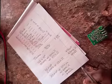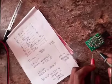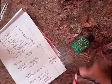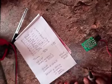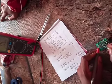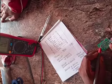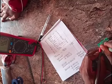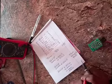All right. Now, we are going to use our meter to try to confirm if it is correct. But one thing we should take note of is this: because it's inside a circuit, the value might not be exactly what we have there, but just know that it's a 47 kilo ohm resistor if you take it out of the circuit. All right, but let's just see what value the meter would read. It should read something close to that. Oh, it gives us the value. So you see, it is 46.9, approximately 47 kilo ohms. So you see how simple these things are.